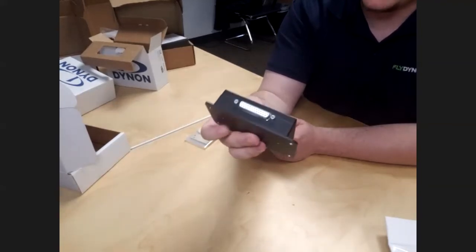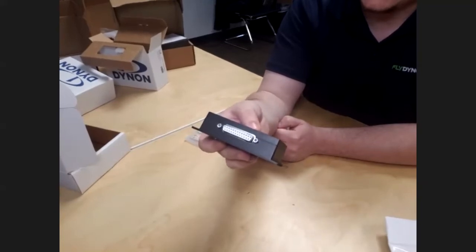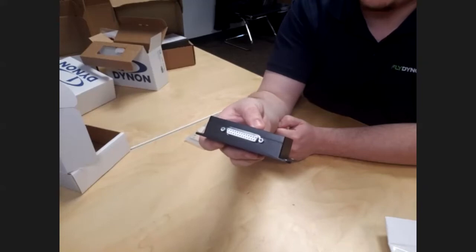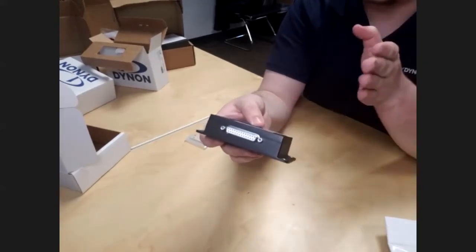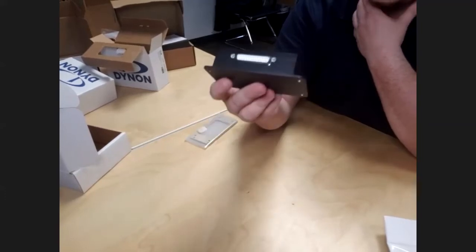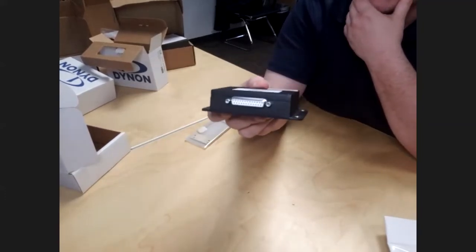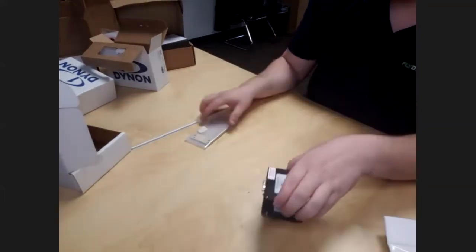There are redundant buses and then also a serial in port, which allows just a GPS position source to be taken from a navigator as well. And that can be wired and prioritized in SkyView so that as you potentially have failures of any one GPS signal, it automatically fails over to the next one you've prioritized. And this is a means of getting another source into the system. So this guy is the same size as the air data computer, the ADAHRS.